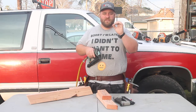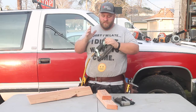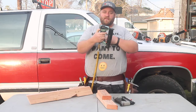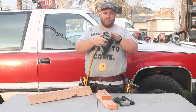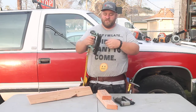Now they do not have a head, so they don't have a lot of holding power, but they will suck things up and hold in place while you're gluing things. It is a double-trigger system, so you have to pull one trigger and then pull the second trigger. As soon as that first trigger is pulled, it will shoot — it doesn't have to be pushed up against anything. So don't put these up against your leg or walk around the room, because you can accidentally shoot yourself.